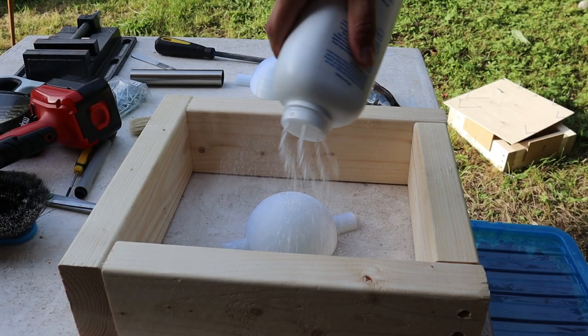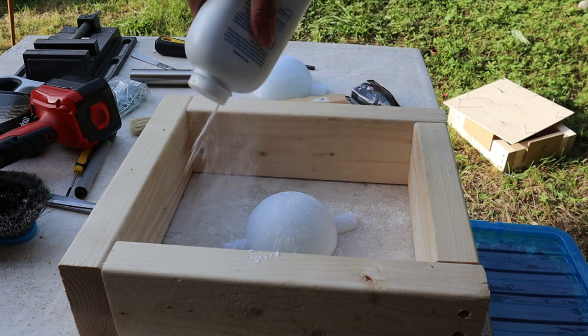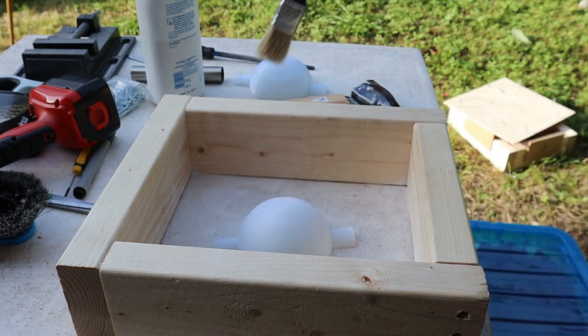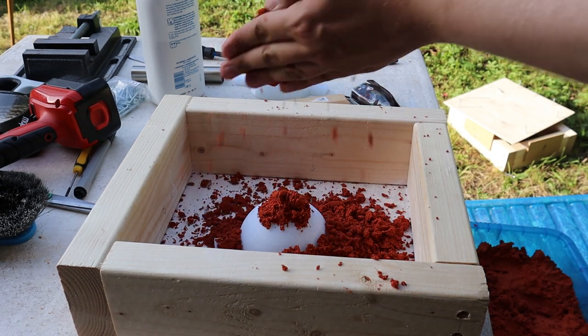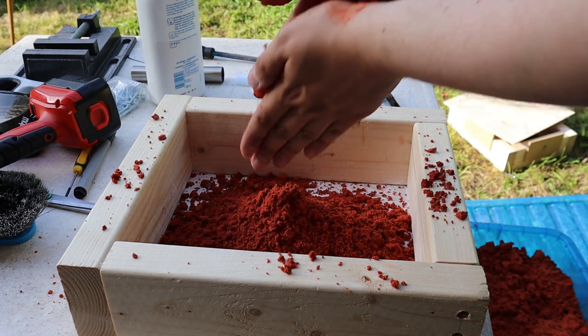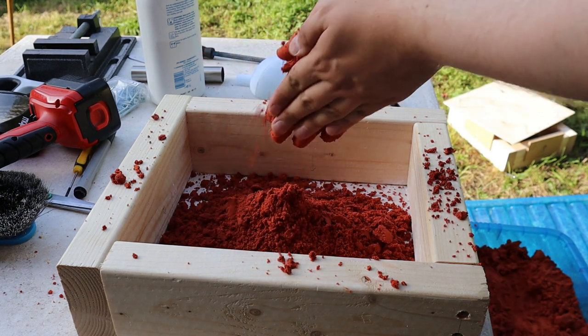As an experiment, I decided to give sandcasting a whirl anyway without the core. Next time, I'm going to change the design of the core mould to allow for easier separation and more penetration of the carbon dioxide. I'll also use welding gas as a source of the CO2.